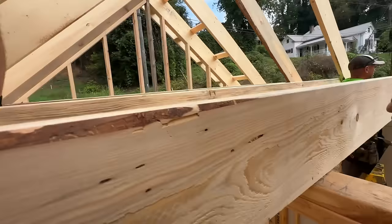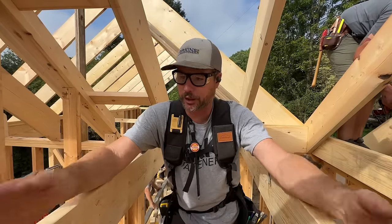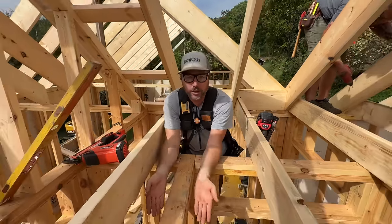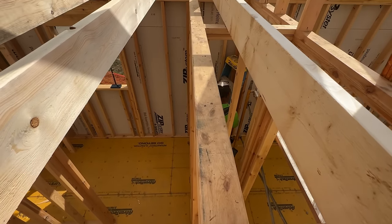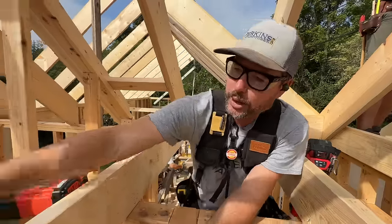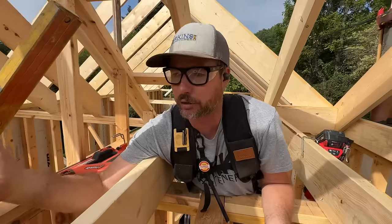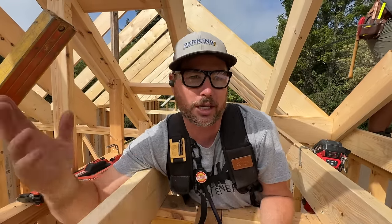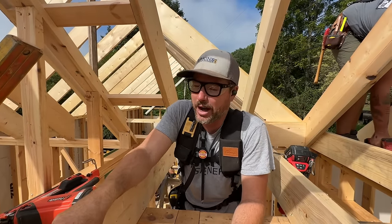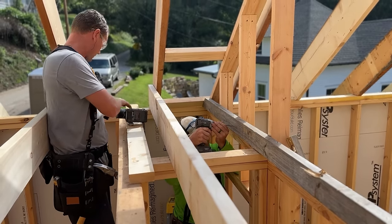Impact. I'll go get my drill. I didn't realize. Impact. Hey, we got our ceiling joists up here, but there's still places where you couldn't nail drywall up, like on either side of this wall. You got nothing to nail to, so we're gonna add deadwood, they call it, on either side and let it stick off like 2 inches each side. We're gonna add some deadwood here so that the drywall's got something to nail to there. We're just gonna look at everything and make sure that when you go to nail drywall up, they're not gonna call us back and be like, hey, I can't nail this up. There's nothing to nail it to. Yeah, they're not very nice. Yeah, they're not happy when that happens. Hey, that's some old deadwood. It's dead and it's old. It's reclaimed.